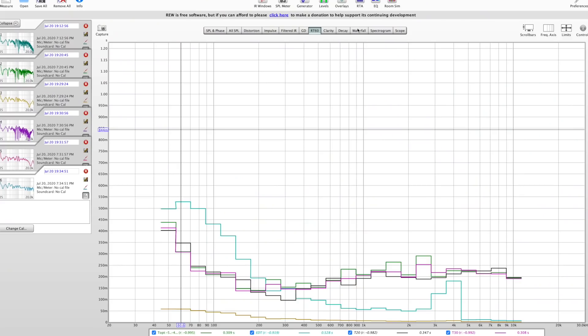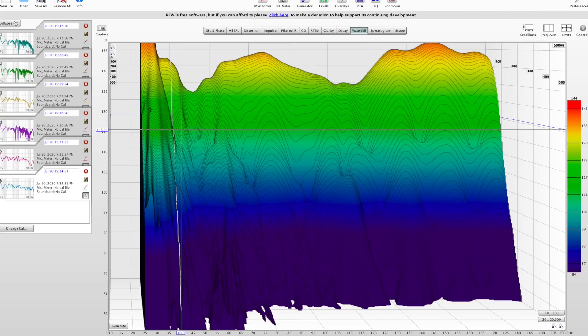The 30 Hz issue — we'll get there eventually, one of the acoustic guys will tell me how to fix it. And for 50 Hz, I'd love to bring it up 5 dB, but worst case you can solve it with DSP and get to maybe plus or minus 3 dB, which would be amazing — you usually spend a ton of money to get there. The RT60 looks good; the waterfall also looks really good except for 30 and 50 Hz. I'm happy — all of this was worth it.